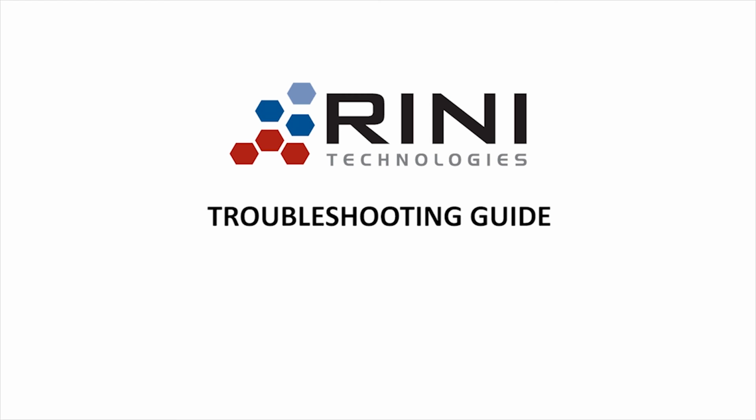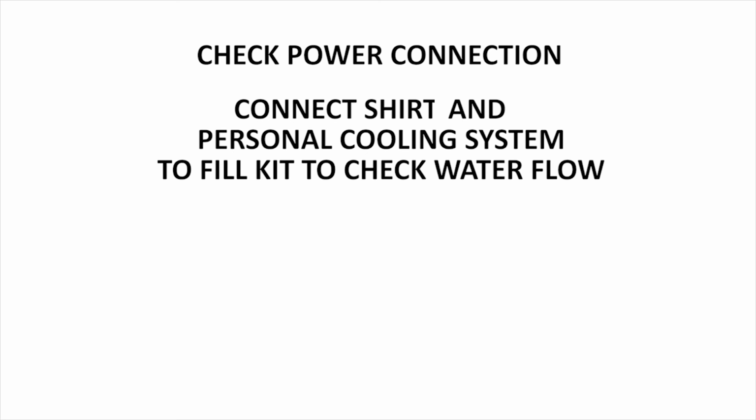Here are a few things to check if the personal cooling system is not providing adequate cooling. Check that the power connectors are secure and that a 12-volt DC power source is supplied to the 2-pin SAE connector. Connect the cooling shirt to the extension umbilical and connect the umbilical to the fill kit connections. Connect the personal cooling system to the black connectors on the fill kit.